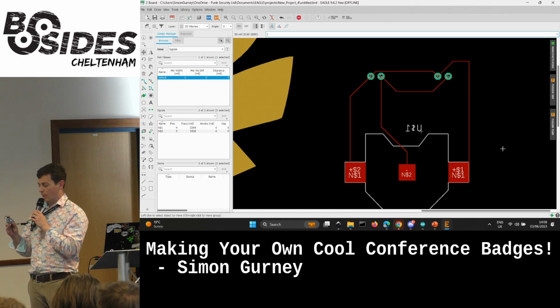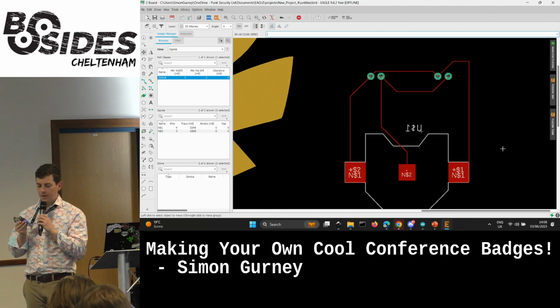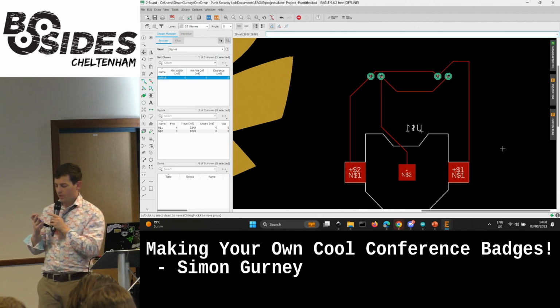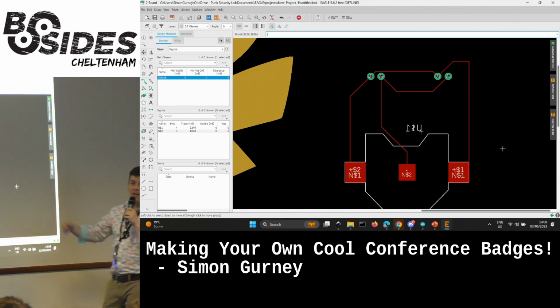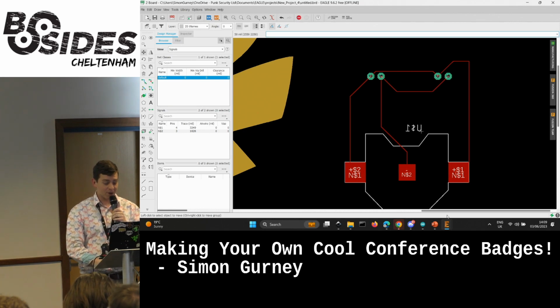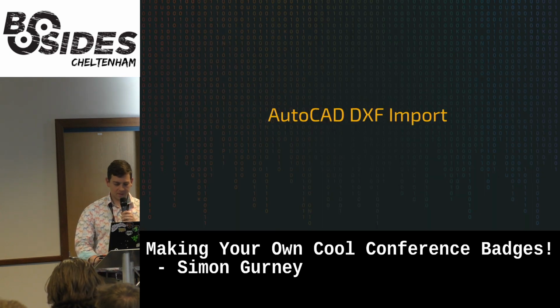Obviously, the more parts you put on, the more complicated you get. Some parts, you might find that you just rotate a part to unblock something, or you move it over. I've done some right janky things with some of the boards, where you make an imaginary component with two pads, like a really big resistor, and then put one on this side and one on that side. When you get the board, you just put a big blob of solder on and jump over it like a bridge, which works. So I'm not going to knock it. Anyway, back onto the slide.